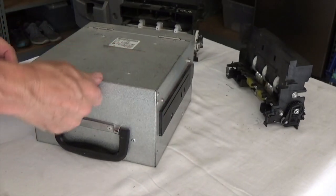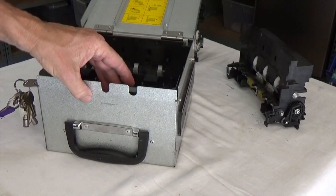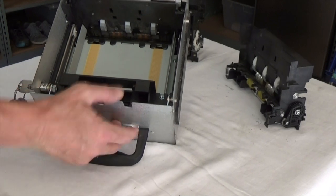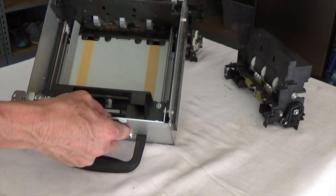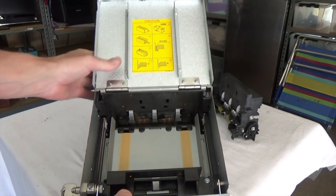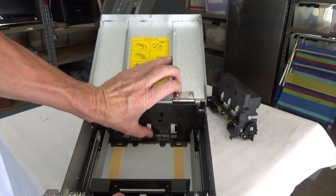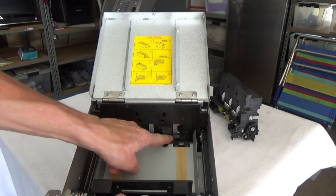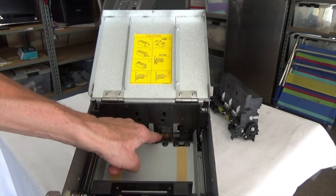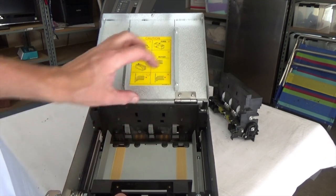Alright guys, follow me over here and let's take a look. We're going to open it up with this key here. You can see it's locked. Once I've opened it here, I'm just going to simply pull this back. This thing here pulls back and stays back. You are going to need a Phillips screwdriver, two sizes, a short one and a longer one. We're going to find out, is this piece here good or bad? When you look at this, you can first of all see inside that they look rather dark. And if you touch them, and if they feel soft and gooey, then obviously it needs replacing.